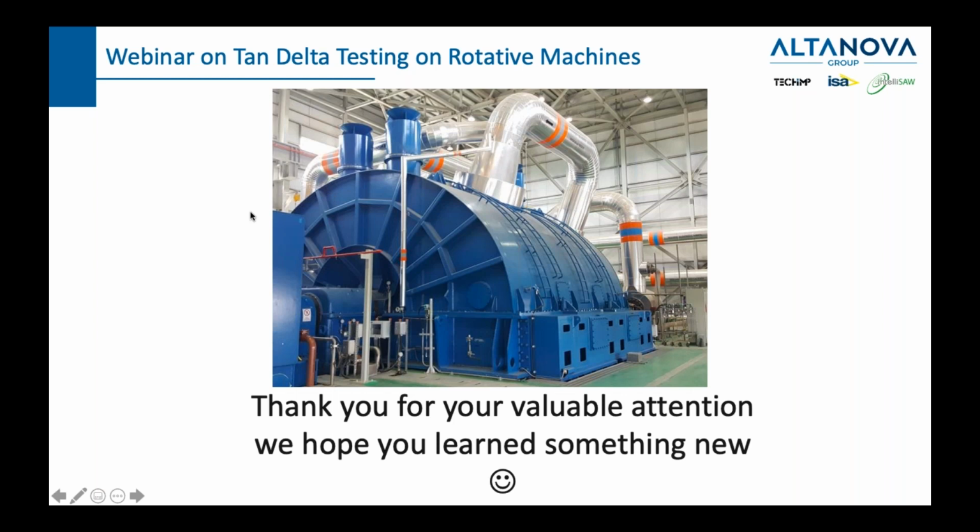Are there other tests similar to tan delta? Well, there are other tests which can tell you the status of the insulation. They are DC tests, but they're not like tan delta, because the tan delta is an AC test. I would say that it is the only test I know which has all these qualities, but there are other tests for insulation. For me, this is the best test for insulation. It is the faster test for the insulation and more easy. The other ones are complementary, we can say.